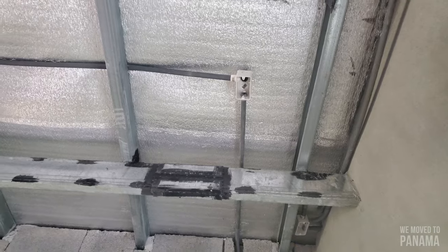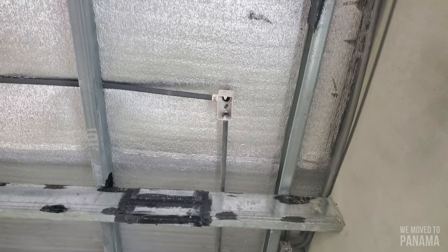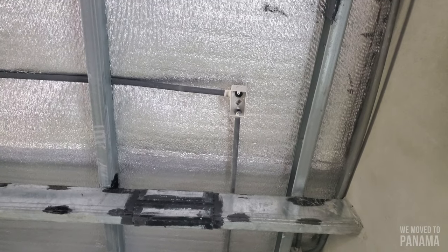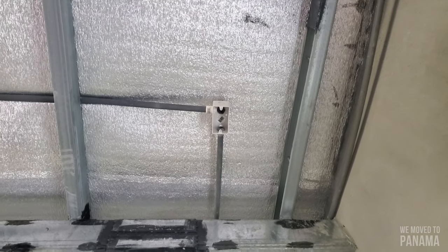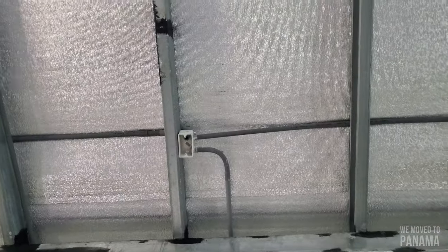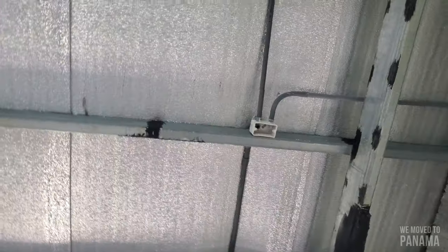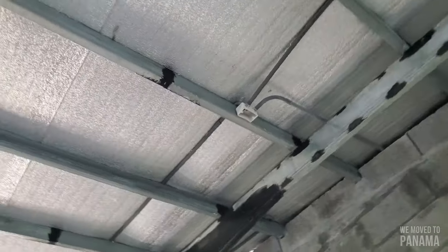But while I'm here, you'll see each and every place where the wires are splitting, or I would say a bridge like that, looping. You put one of those, and here they've got only that type that I have to use here. In South Africa they're much smaller ones, so they're using plugs and lights, which is a little 2x4 PVC box. So that light will be in one circuit over there. I've run across to the next one that goes down into the wall to over there, and then we go up again and it goes along here to the next one that goes all along across in the roof to the next room with your pantry, and there's one plug over there. Then it goes up over there, got a 90 bend that goes all along through there and top.